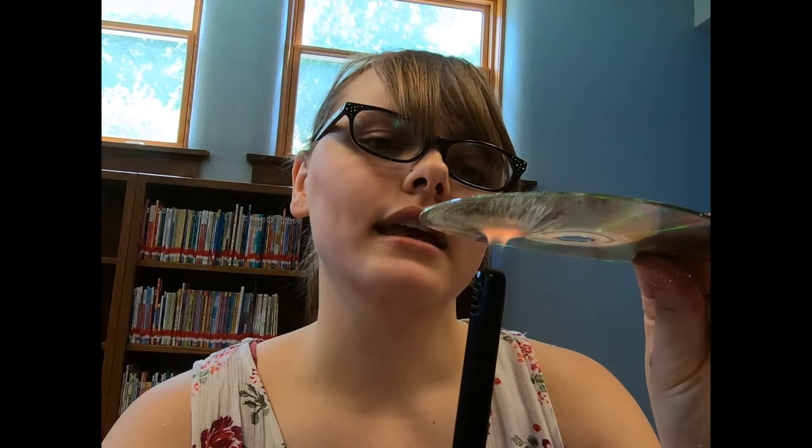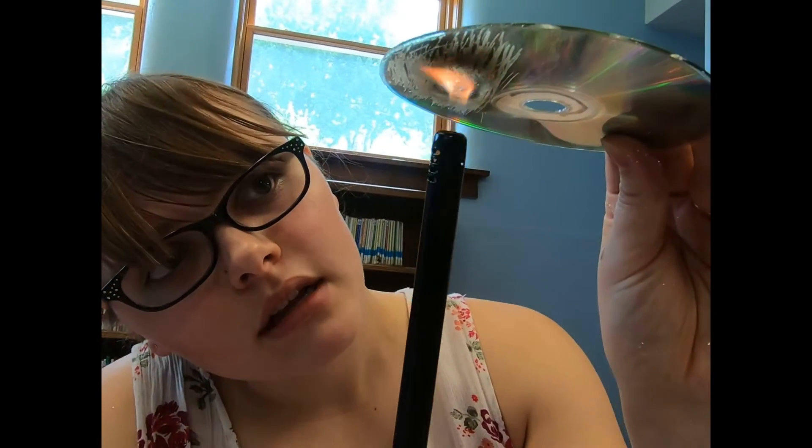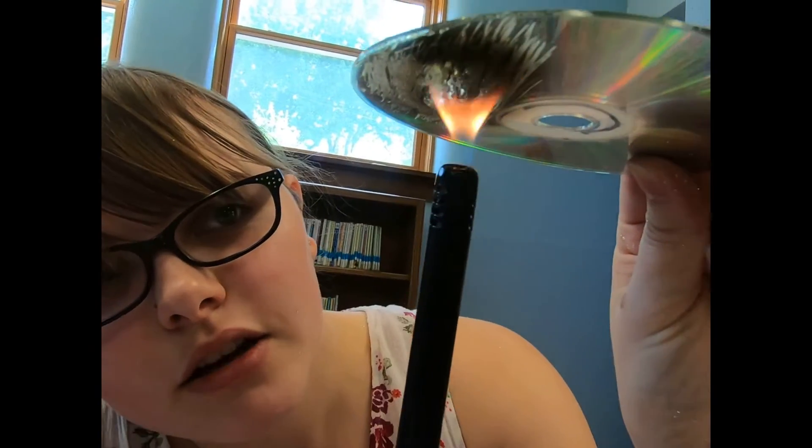If you watch, you can see how the plastic — it takes a minute — but it starts to get kind of shiny like a puddle. It's not going to be super clear, there's still lots of scratches, but you just keep running it over. It'll take a couple minutes, but you can see the plastic is starting to bend and warp. That's because this type of plastic is a thermoplastic — it melts in the heat. There's another type of plastic called thermosets, which, you guessed it, does not melt. You can see there's a little bubble forming, so let's see if it's ready.